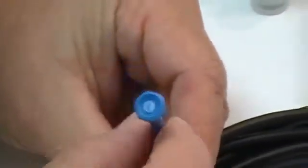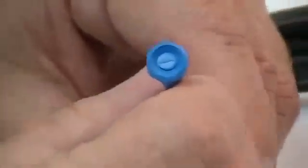Next, you will take your membrane. You want to select an O-ring that came in the protective cap. Put the O-ring into the membrane and, with the screwdriver, tap it down onto the shoulder at the bottom of the threads. This is black on black, so it's difficult to see the O-ring inside the membrane, but there is a shoulder at the bottom of the threads. When you have that done, take your electrolyte solution and very gently — do not squirt — but very gently load your membrane up to the O-ring that you just put in.